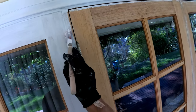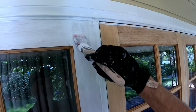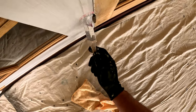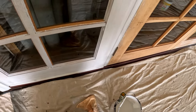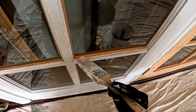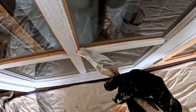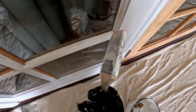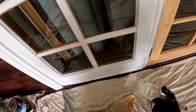Cutting in around the hinges — make sure the paint doesn't get on the hinges. Hinges should be clean no matter what door you're painting. When painting the smaller timbers next to the glass, it's all about how much pressure you apply to the bristles and the angle. I'm doing a 45-degree angle, so even if I touch the glass it's minimal and can be cleaned easily. With Zinsser it's a little harder than any other undercoat because it's very thick, so it's very hard to cut in.